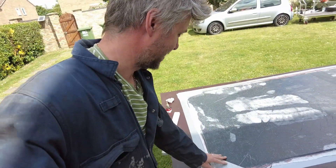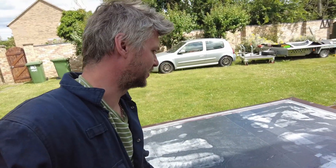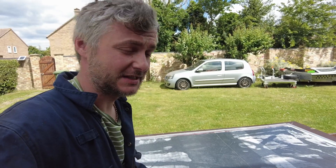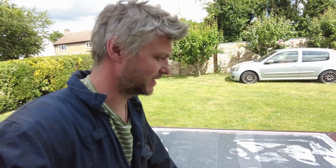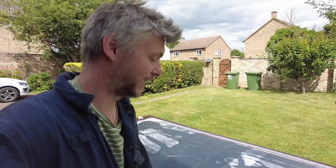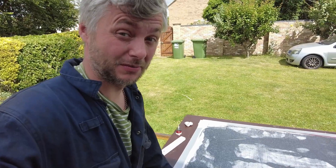This seems to be dry and I think it might have just worked. What I didn't like about working with this material is I used a normal polyester resin — the stinky one — that's why I'm working outside. It goes off really, really quick, literally 15-20 minute pot life. I'm not used to that kind of speed. For large areas it's really difficult — you have to constantly mix it. And it doesn't seem to wet out as well as the other resin, maybe because it sets so quickly. I'm not sure how it's going to turn out, but it's probably okay.